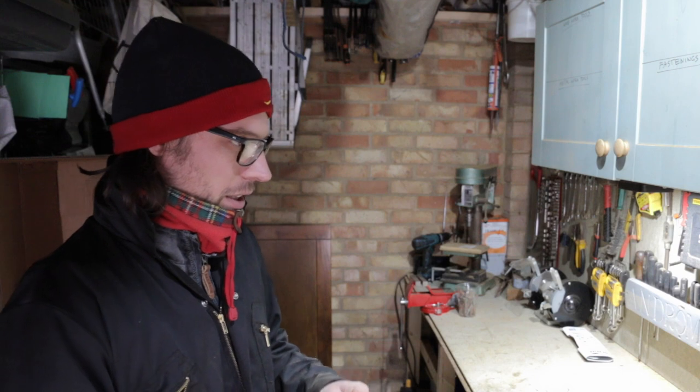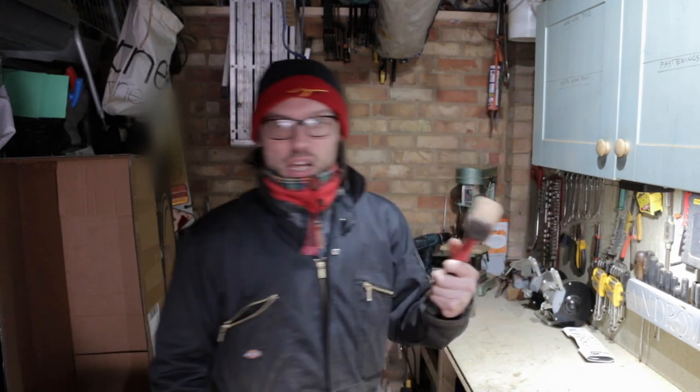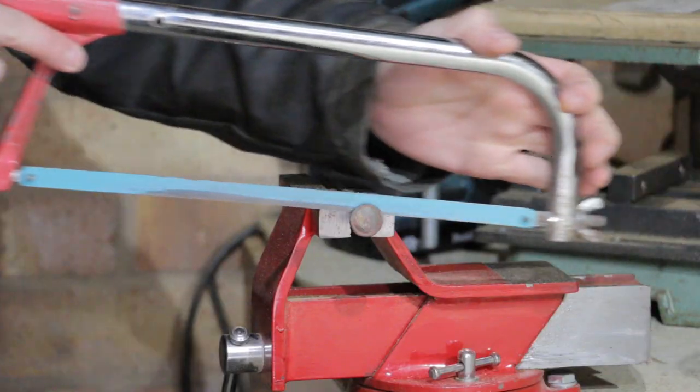So I think if I can get something metal under it, this lump hammer, for example, if I lay that on the desk, lay the rudder on top of it, I can use this ball peen to round over that copper. But we'll clean up these copper rods. I need three nice clean copper rods, and then we'll see where we go from there and see if we can use that as a method to fasten that top strap into the stock.